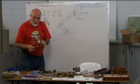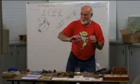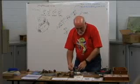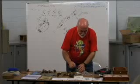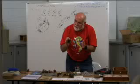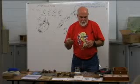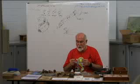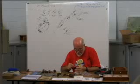There might be a little variation if you're working with silver, because silver is such a beautiful metal to work with. It's very soft, and the metal just creams away from the tool, whereas the other metals like copper tend to be a little bit hard. And there's another factor too, that as one is engraving, you are pressing that tool into the copper. So what's happening is that you are actually work hardening the metal ahead of that cutting face all the time. So the metal is growing in resistance all the time as you're moving through it. It mightn't seem all that obvious when you're working, because you just get used to the feel of it. But after you've been working, especially with a fairly complicated design on copper, it's surprising how hard that surface of the metal will become just from work hardening and the pressure of the tool pushing against those molecules in the metal.